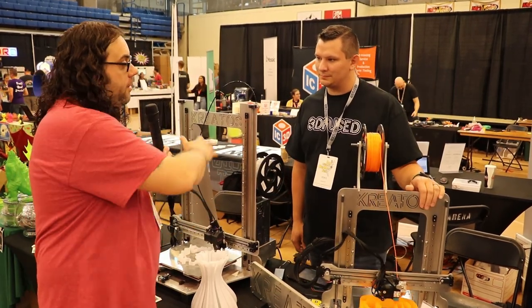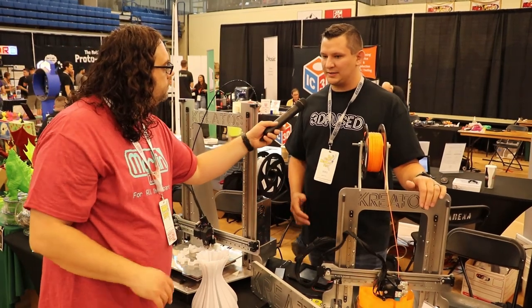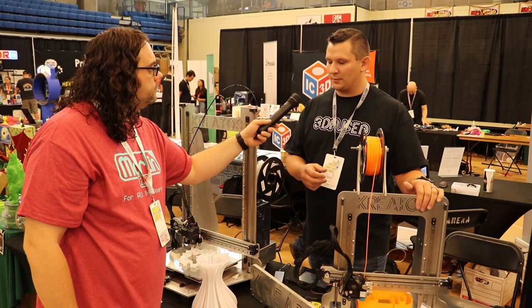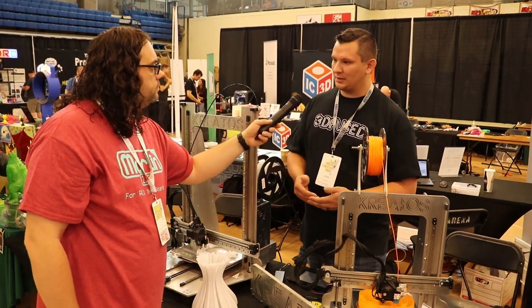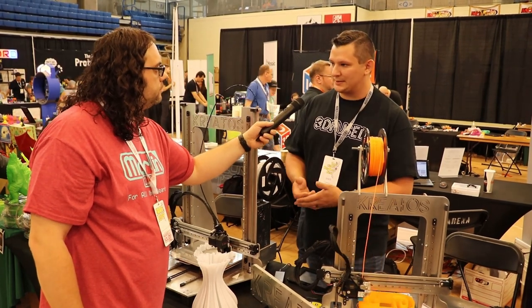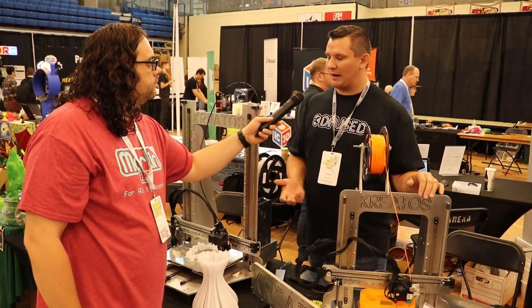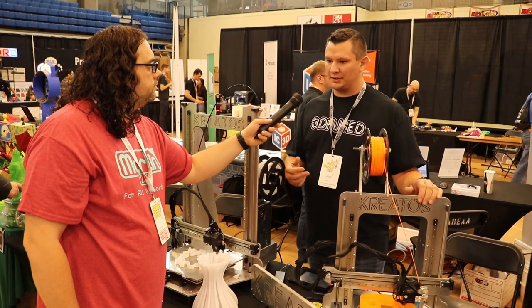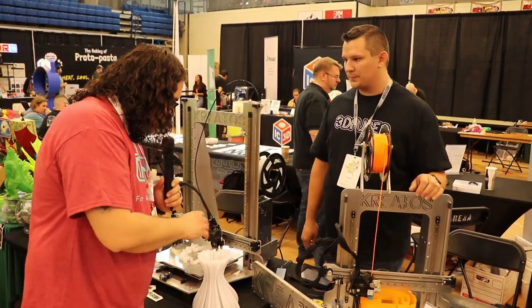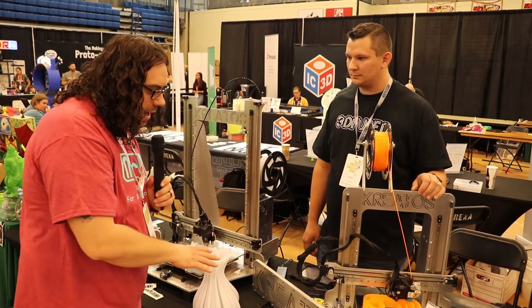So what's the benefit of doing something like this? The benefit is faster motion without artifacting, and linear rails have a smoother motion, so there's less maintenance needed. The only thing you've got to do is oil them. You don't have to adjust the wheels, you don't get flat spots in the wheels, and that is the biggest downfall to the Creality printers — the continuous adjustments and the wear that happens to the rubber wheels.